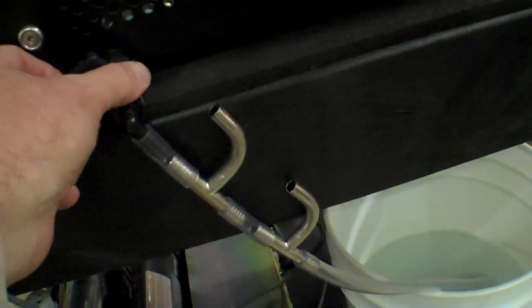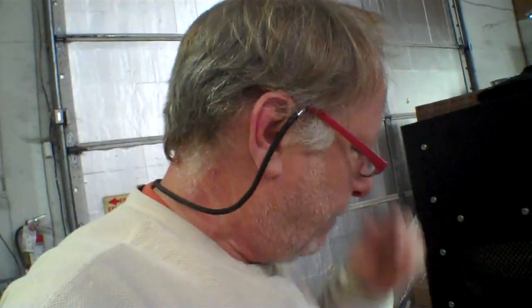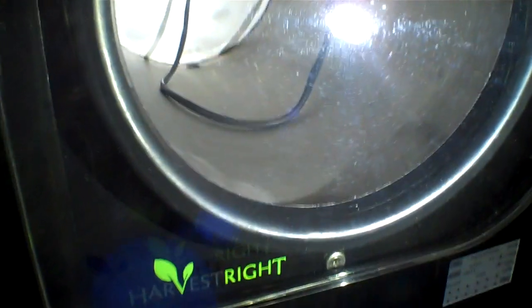So anyway, we're all set up — we're going to do this again. Let me just turn off the pump real quick. Now over here we're going to open this valve up. And here we go. You can see that there's no water coming through. And like I said, you absolutely have to have two of these or it doesn't provide enough air to keep the water from sucking up the pipe. So that's about it — you see that works very, very well and really prevented any kind of problems.